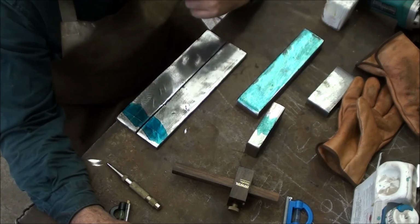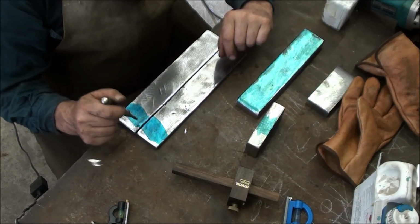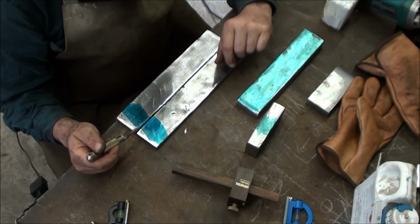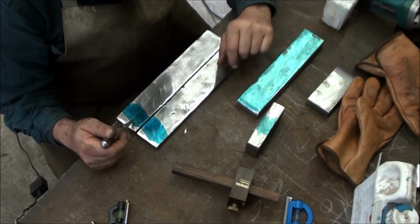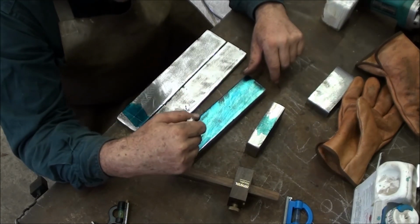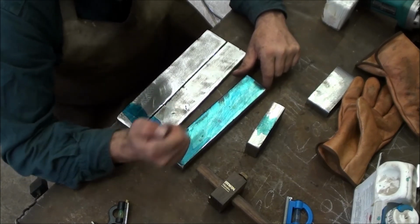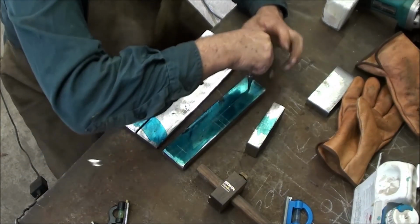So I suppose we're going to use M12s on this. So we'll whack a half inch hole through here, or 12.5, or half inch is 12.7. So it'll be 12.5, 13mm. We might even do it as a 12mm, keep them pretty tight, not that we need to. We'll put a hole through here, hole through there, hole through here. Let's put a centre pop in. Let's make that a bit tighter. And we'll put a centre pop in there.